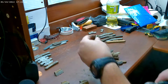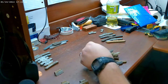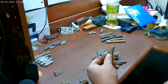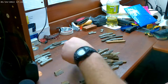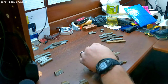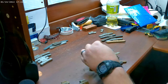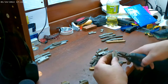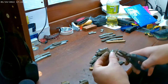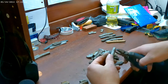So that's how you approach this stuff with people. Some of them are painted, all of them are dirty, but when you go to melting them all that dirt, paint, and steel clips float to the top. You'll scoop it right off. I will definitely make a video of that and show you how to clean it up when I get to that point in the process. Right now I'm just stacking some, testing it, and sorting it.